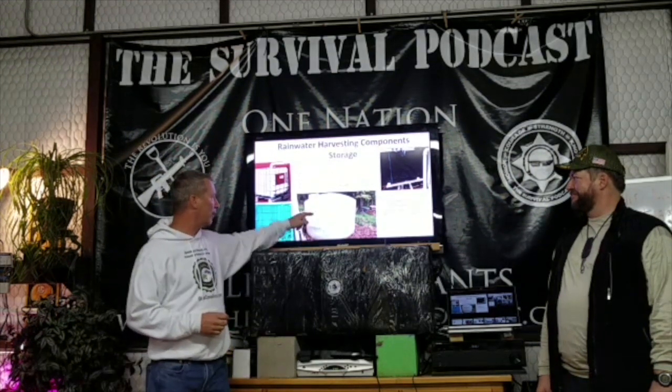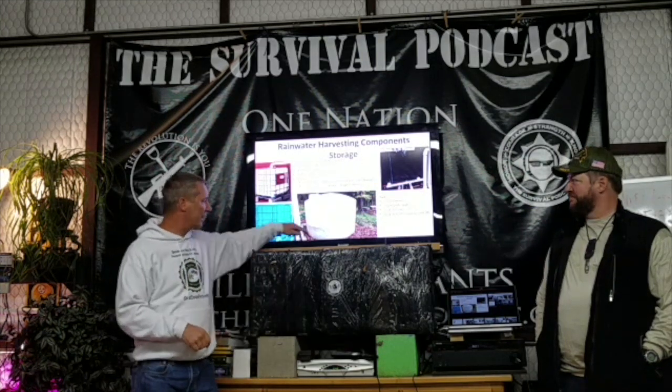Wow. Nice. On Craigslist. So this one had a crack, and I think you can see it right there. And the other one had a hole in it. They sell a polyethylene welder, which is nothing more than a big soldering iron. Basically you melt the polyethylene, put some screen on it, and they give you some polyethylene, like solder, and you just melt it together. Make sure the screen is on the inside, and I can make that thing as good as new. So I ended up walking away with 2 tanks for $450.